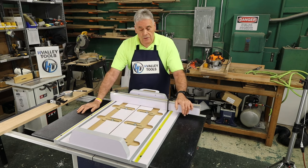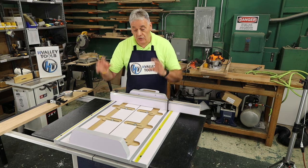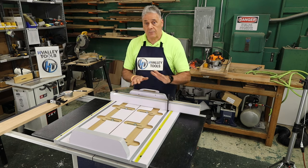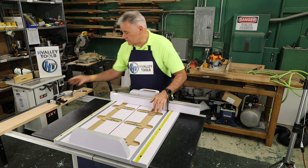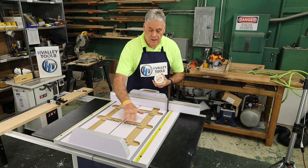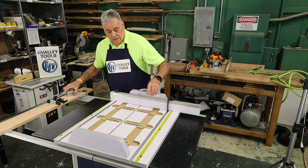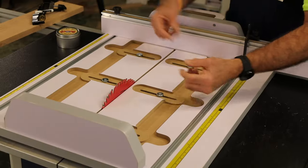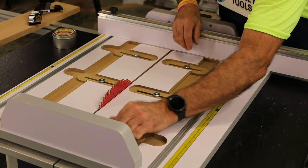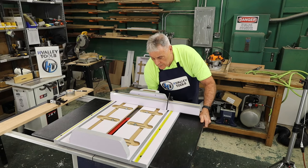Now the factory cuts these perfect — and I really mean perfect. They are so perfect, they're so tight, sometimes they get stuck and it's not a big deal. What we do is use a little beeswax on the exposed HDF and on the underside of the insert. Works great — they're like butter. The trick is that you just move them uniformly and then you loosen your little screws here and move them uniformly. And then you bring your blade up.